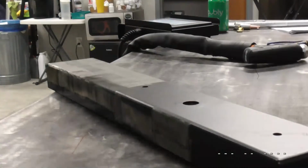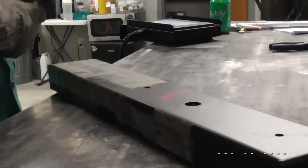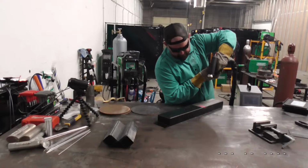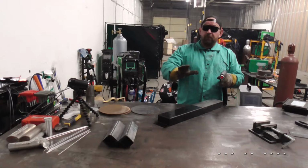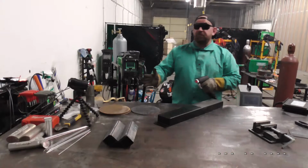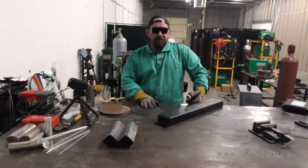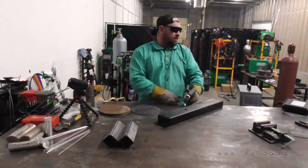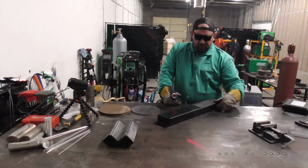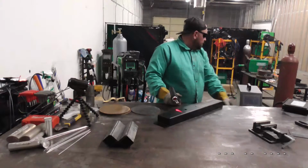Here's some powder coat. If you do any powder coat work, this thing could be an absolute lifesaver for you. Let's go to the wide shot real quick. Again, this is 50 watts of power. That's all we're using out of 1,500 watts. I didn't know what I was doing when I first got this thing in. I turned it up to 1,500 watts, and it'll actually start to boil the surface of your material. So you don't need 1,500 watts. About 300 is the maximum.